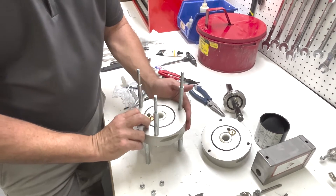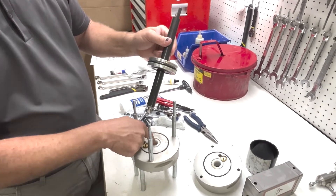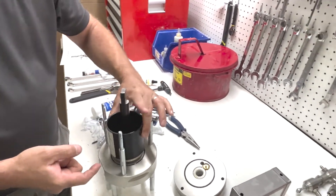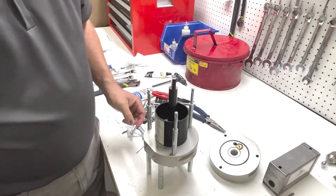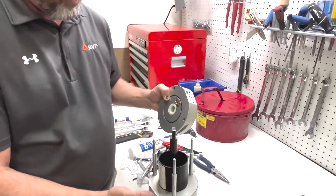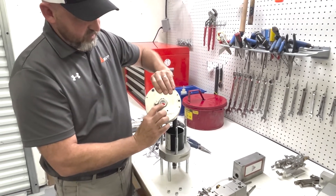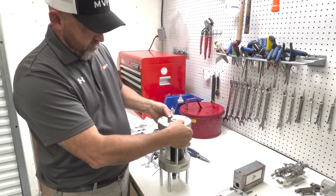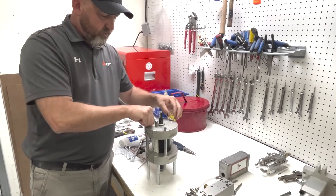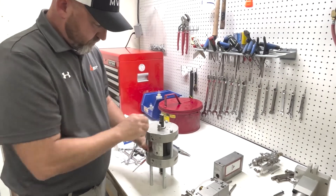Now we're going to flip it back. We've changed our o-rings on our piston — we're going to lube everything up, lube it down in here, put our piston in, take our cylinder and lube it up, and push it right down over it. This top is exactly the same as this, so when you change all these, you're going to change these the same: change this o-ring, change the bushing o-rings, and slide it all back together. Put the top nuts on and make sure when you tighten these to go a little at a time and make them even when you go all the way down.